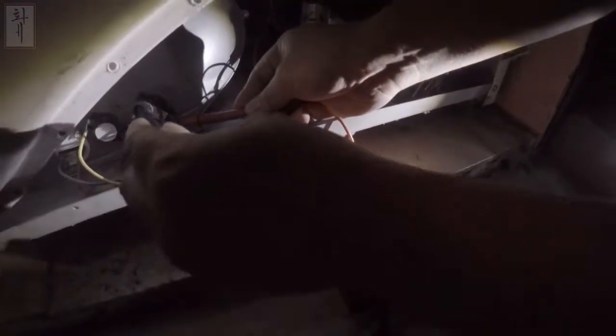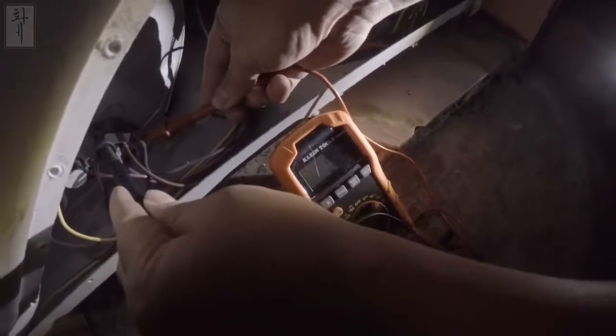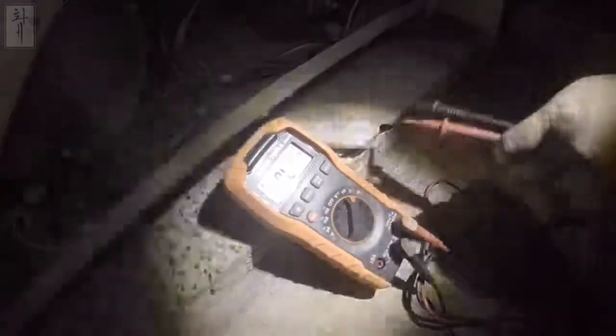As long as it's not OL — it's like open load. It's just gonna be like... you can see that. See? It has 0.01 right now — that means good. So this one is good, it's working. That means there's continuity. Continuity everywhere. So everything is working. It's just that — that was the problem. It was the triggering.